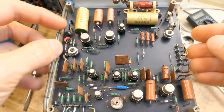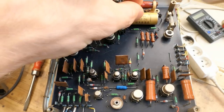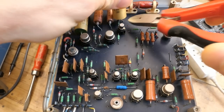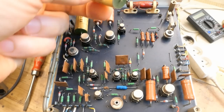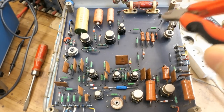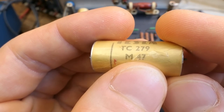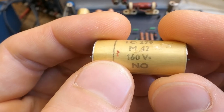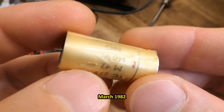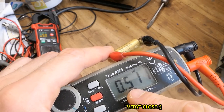The board is hard to remove — I'd have to resolder a lot of wires — so I'll snap the capacitors out and solder new ones directly to the pins. Leaving a couple of millimeters for testing and plenty for soldering the new capacitors. This is an old polyester capacitor made by Tesla: M47 means 470 nanofarads, 160 volts, and the date code says 1982. The capacitor is sort of peeling and falling apart. Measuring the capacitance, it's actually very close to 470 nanofarads — reading 511.